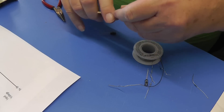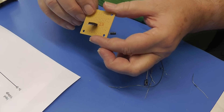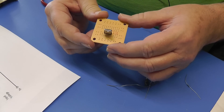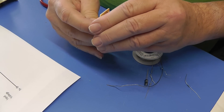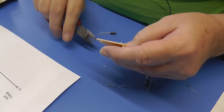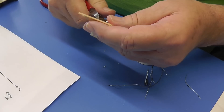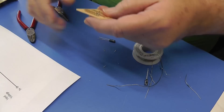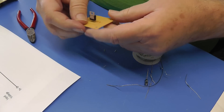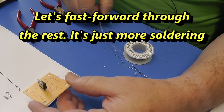The voltage in comes in on pin number three, which is this one over here. So this is now in. I can take off these extra leads because they're going to get in the way. I put a finger on them before I clip it — that way the finger absorbs the energy of the clipping. The numbers are: one, two, three. Three is voltage in. Two is voltage out. One is the adjust. So what we want to do is put these resistors over here.